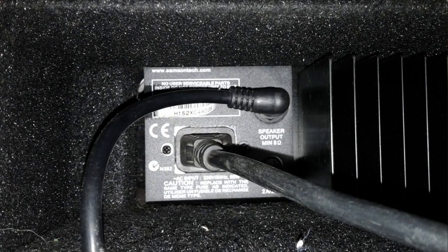So then I go to plug the original bass amp back in, and as I'm plugging the IEC connector in I feel something rattling around. I take a closer look and discover that on the back of this combo amplifier — with the amplifier unit in the top of the cabinet — next to the IEC connector where the power plugs in, there is a quarter-inch TS jack which carries the amp signal from the amplifier in the combo to the internal speaker.